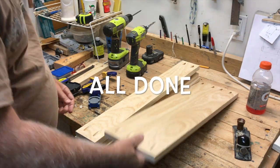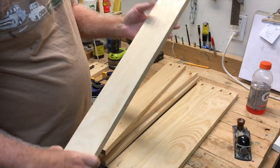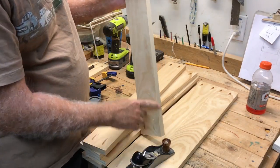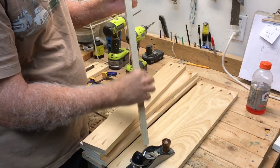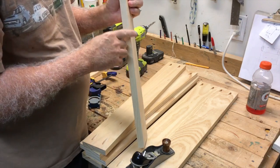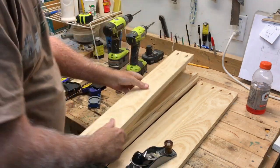Okay, so I used all the kick plate and the rails, so one of the things that I'm actually going to do is take my plane and put a little chamfer on all these corners. Since we know children are going to be in and out this door, we don't want anything real sharp, and these are pretty sharp edges. So we'll just do that.